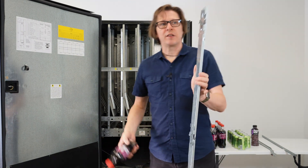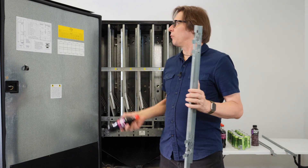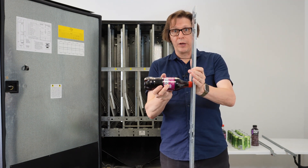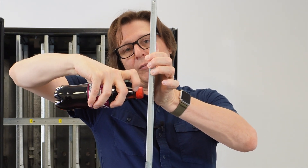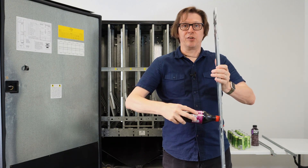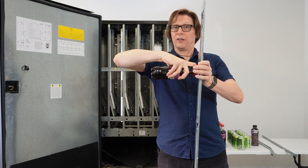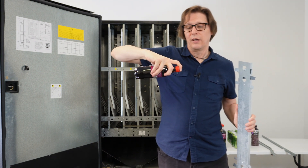When adjusting the back spacer, we're looking to keep the product towards the center of the machine. When loading bottles in the rear, the caps face the rear. I've always found it better to take an index finger's depth — put your index finger over the cap of the bottle and that's about how much gap you want, roughly a quarter of an inch. We want a little bit of play because we don't want to restrict the bottles descending into the cradle, since the motor runs at a constant rate. If I can get my index finger between the cap of the bottle and the back spacer, I know I've got a good setting.